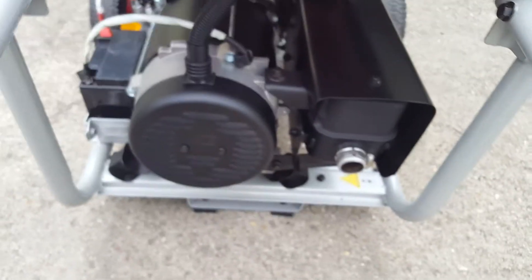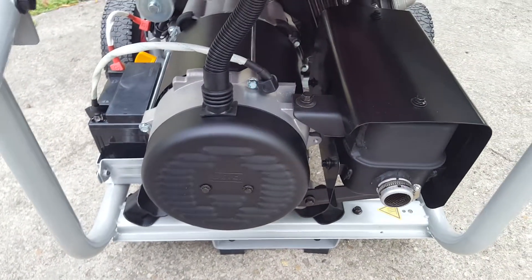Then there's the front rest on the bottom with two bolts — you install that underneath. It's a stabilizer for the generator. They tell you to make sure you have three millimeter clearance when you tighten it up.